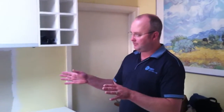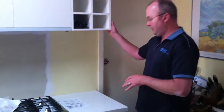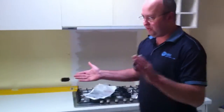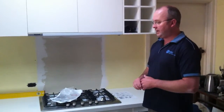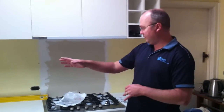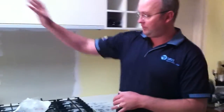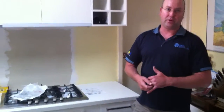So we were just discussing shapes as far as same measurements. This is a real trap for beginners where they'll come in, they'll measure up, and they'll have 704 height, and they'll go, right, beautiful, 700, and job's done. But if they haven't put a level on the bench, and I have seen all too often benches running out 10 millimetres this way and then 10 millimetres that way, which is telling us it's a parallelogram. Unless you create that shape, a square peg won't fit around.